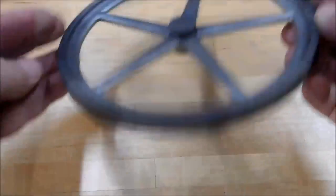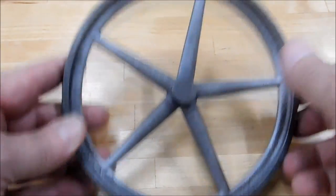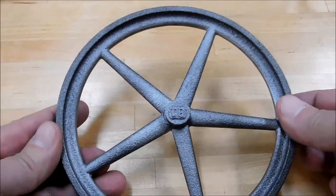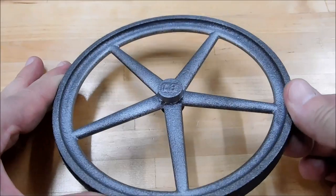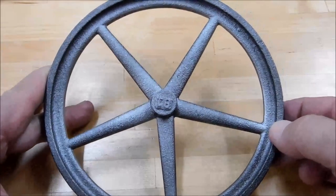You will have to flip it, establish your concentricity, make a finish cut, and then flip it again and make a finish cut to be concentric to the other side. That's the only way to get an error out of a part in a chuck bigger than the adjustability or throw of the chuck. Put this in a collet right now, you would not be happy, because I did.